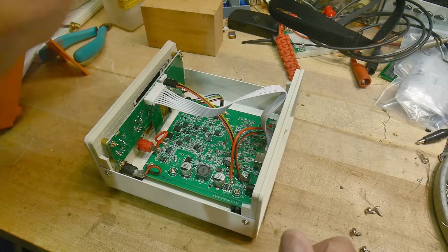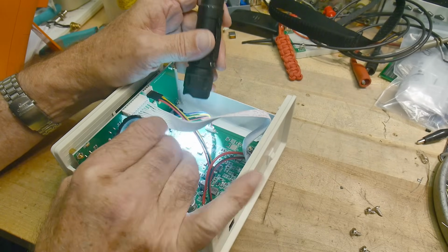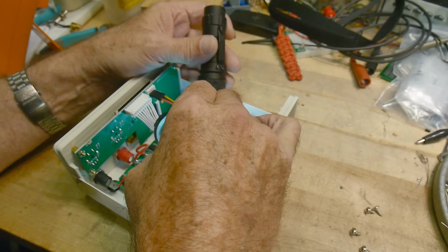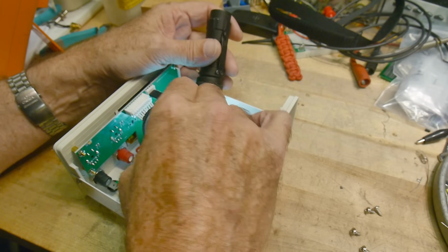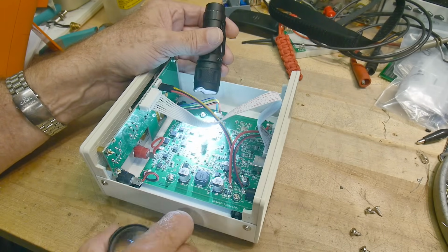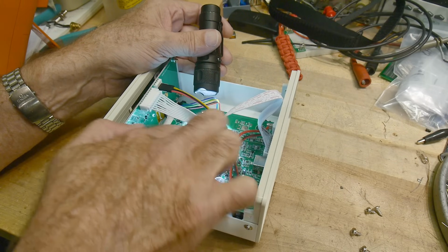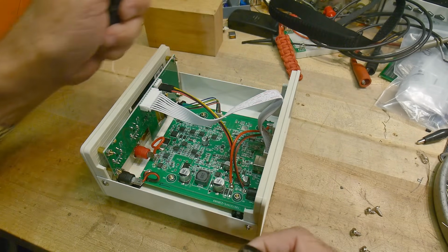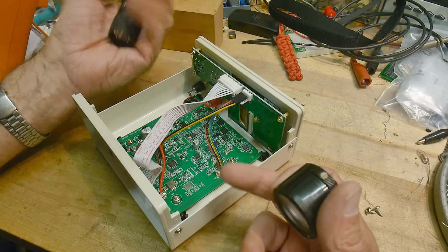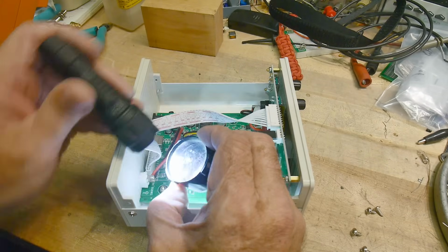But yeah, let's just take a look at some ICs in here. Let's see here. We got a whole bunch of little ICs. What are these? TL081, TL081, a TL081, and a TL081. We got 4 TL081s. Wouldn't you get a TL084? I guess these single jobbers have offset on them if you needed to tweak the offset, but there's no potentiometers anywhere. You could probably get away with just a quad package. I don't know. Let's see, what is this little funny guy over here?